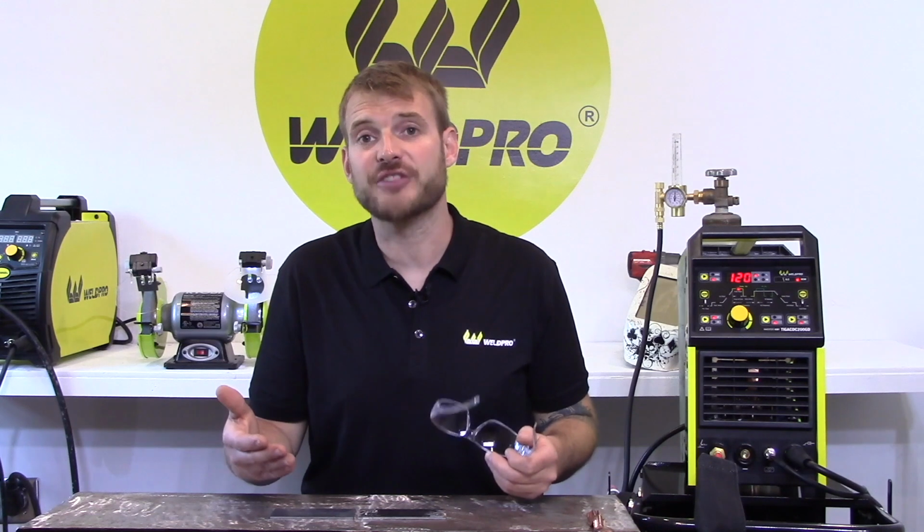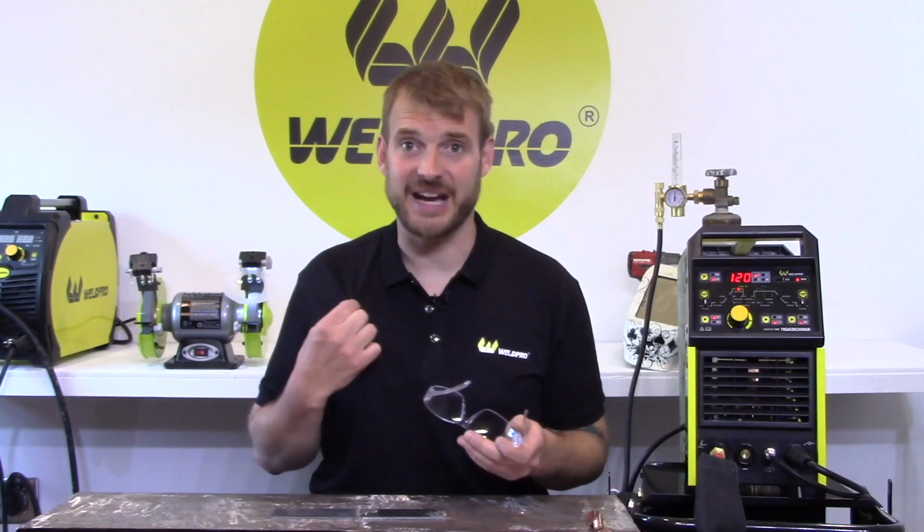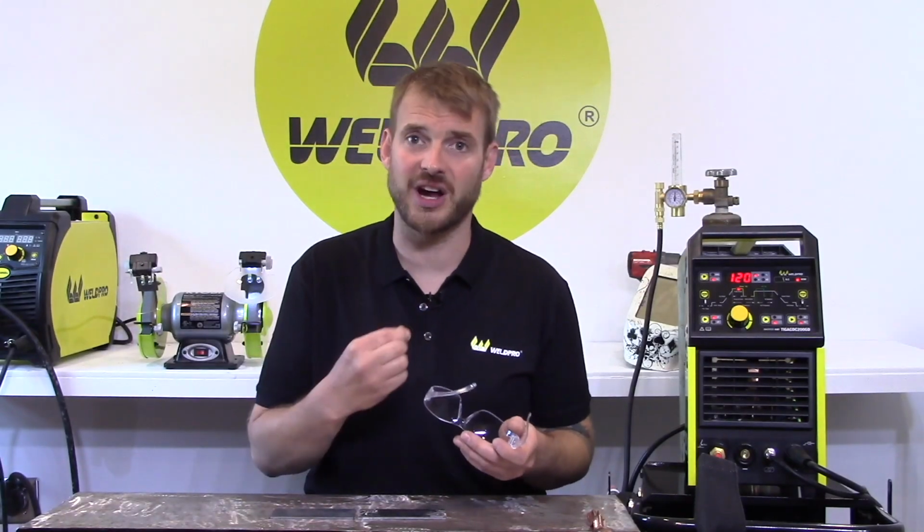Now, a couple things in the way of safety before we get started welding. Number one, you always want to wear safety glasses. Just as any experienced welder, slag and debris finds a way to get in your eye no matter what. You'll want to make sure you have a welding jacket or a long sleeve cotton shirt. The reason we choose cotton is because it's naturally flame resistant. If you're wearing something that's spandex or lycra and a piece of hot steel lands on it, it will melt and often melt directly into your skin. Cotton doesn't do that, so it's the preferred material to weld with.